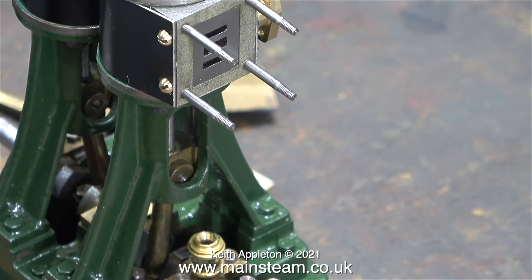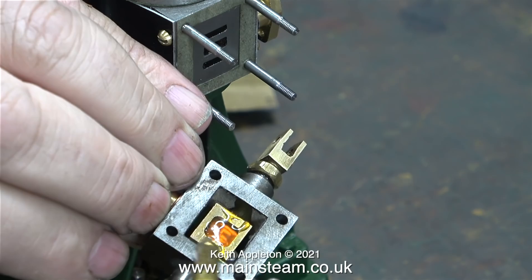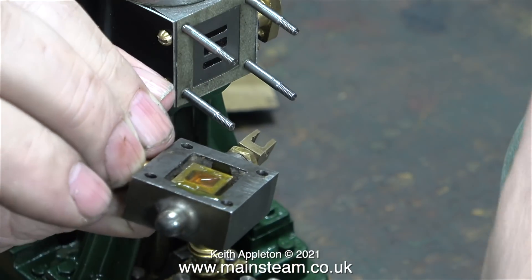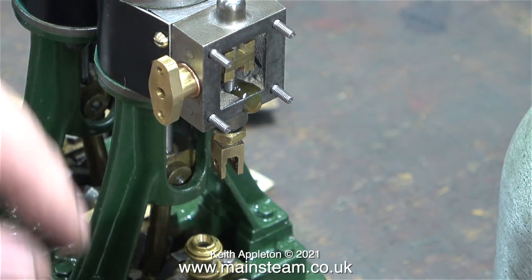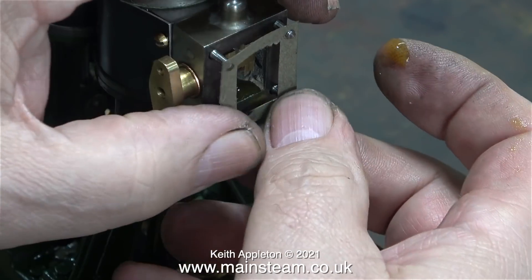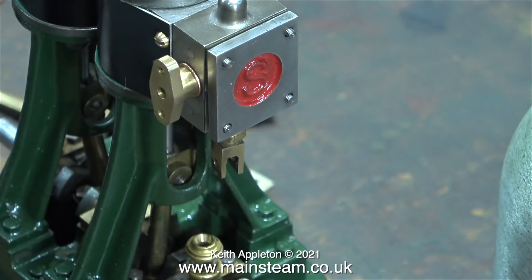It is of course very important not to omit the gaskets. And it's equally important when assembling a model steam engine, or any other kind of engine, to apply some oil during the assembly process. This is super heater steam oil, and I'm using this on the cylinder because inside the cylinder is a piston with a silicone o-ring. Silicone o-rings can actually be attacked by certain oils, but not by steam cylinder oil.